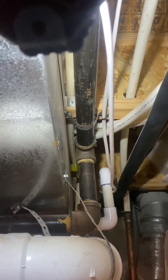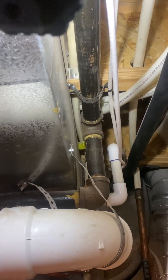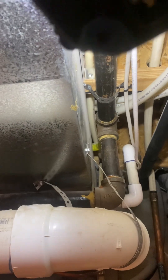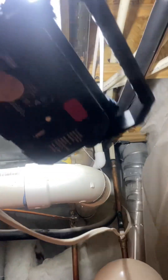Right now this duct is 24 inches and we're putting 25-inch duct there, so you have just one inch to your gas line. You're going to have to smash this duct in, remove the strap on the gas line and redo that. I would even pull the gas line over a little bit with a strap if you could, if you need to — but it's going to be tight.